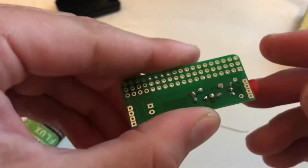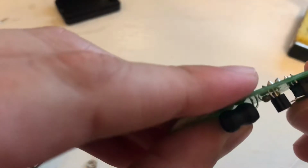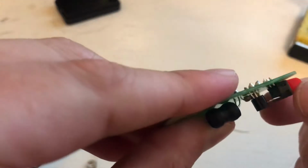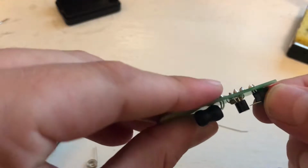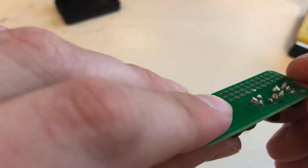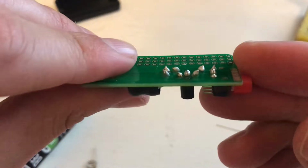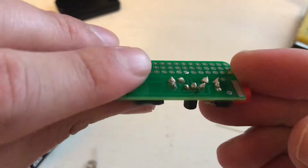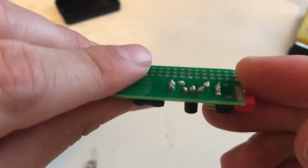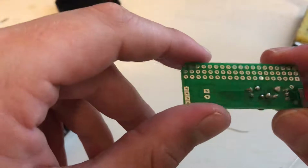JK, it's totally wiggling. Let's see here, is that wiggling because of the solder, or is it just going to wiggle? I think it's just really going to wiggle, because it's actually looking decent. I'm not too disappointed in the way those soldering joints turned out, people. Look at those other ones, though. Some of those are really ugly. You guys are going to make fun of me for those. Look at that big one right there. I think they call that a cold solder joint. I don't know. But again, I don't know what I'm doing. So, we got that down.